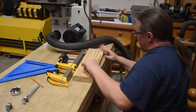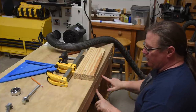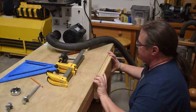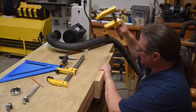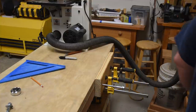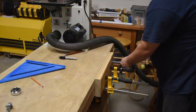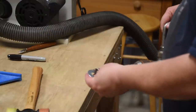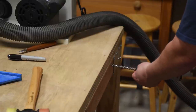From there, position the vise jaw on the side — I personally work off the metal hardware to make sure the threads aren't going to run into any of the 2×4s running the other direction. Position it so it's flush with the top, or maybe a little proud so we can plane it back, then clamp it down. Take your threaded rods, drop them through the holes — which are sized to pass all the way through — and give it a whack to locate the hole. Then replace your bit with one a little smaller, put a washer over the bit, find the hole, and position the washer right in the middle.